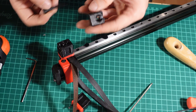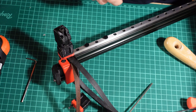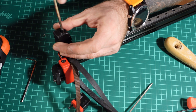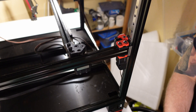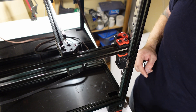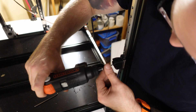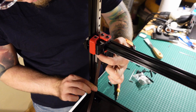Now that the base and belt are secure, let's take one 40mm M5 BHCS screw and attach the plate — the part which is then attached to the carriage. I will not tighten them down yet; just slightly so they can still move freely. Now let's secure this block to the carriages using 20mm M5 screws, one for each carriage, to get the whole construction level. At this point I'm 99% sure I can tighten these carriage blocks, which I'll do now — yes, I'm using some power tools to assemble the 3D printer, sorry for that.